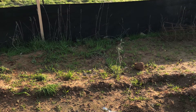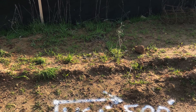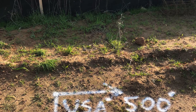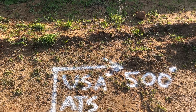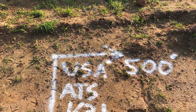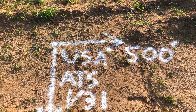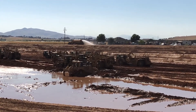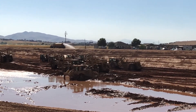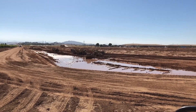Now we're going to get into some rough grading clips. As a reminder before we get started: if you're ever doing any kind of underground excavation, whether with excavators or equipment like we just talked about, make sure you give USA 811 a call. It's a free service, and utility companies will go out and mark underground existing utilities. This will prevent potential injury or death and is required by most companies in this industry. The first clip you see here is a cut and fill operation with 637 push-pull scrapers. It may look like chaos right now, but we're going to get into the details and it'll begin to make more sense.